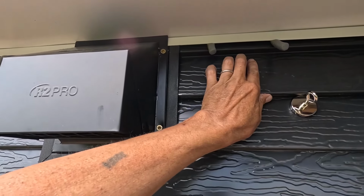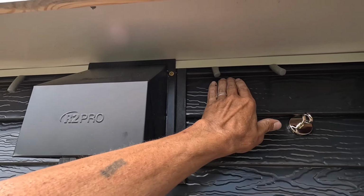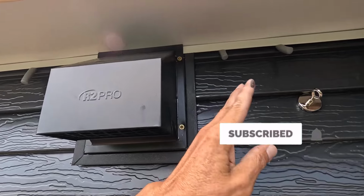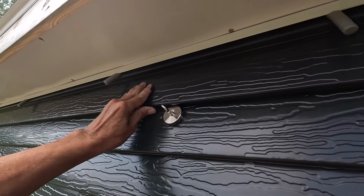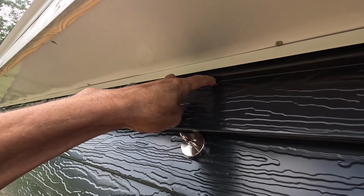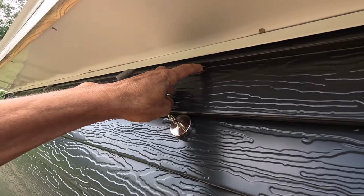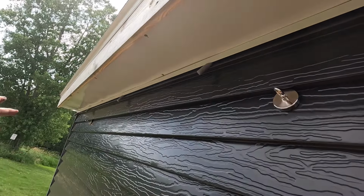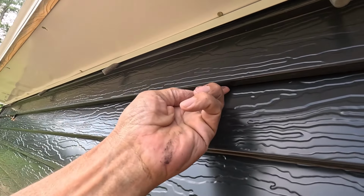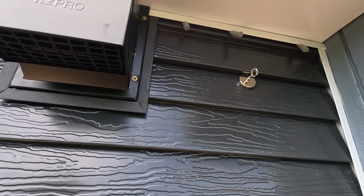These are just holding this tight up against the building while the glue dries. This top one is siliconed in place, because there was no way to get it fastened otherwise. I could put color nails like right here, but I don't think I'm going to have to. I got this silicone the entire length, at this joint and at the joint right here. So I don't think it's ever going to go anywhere.